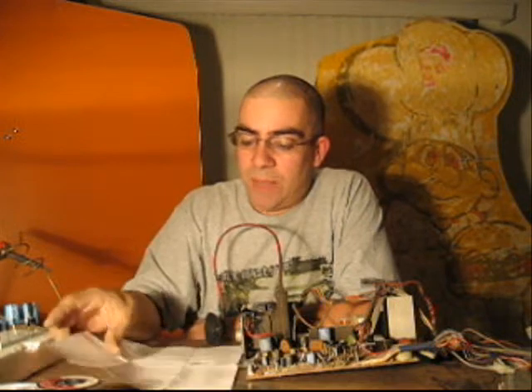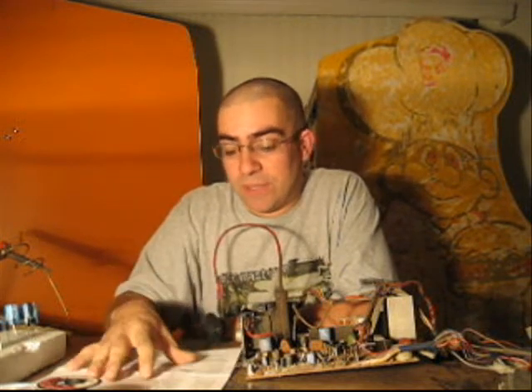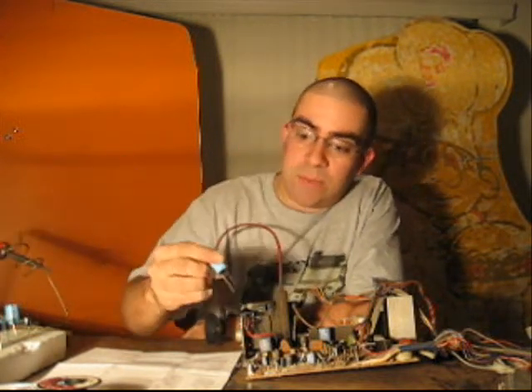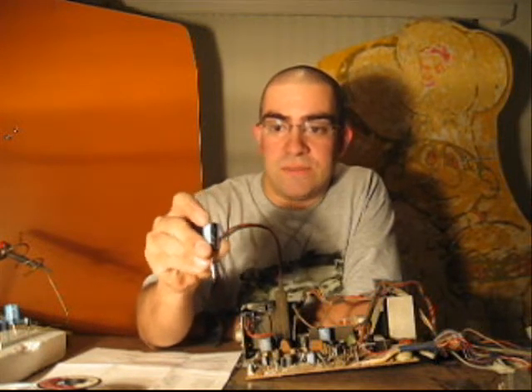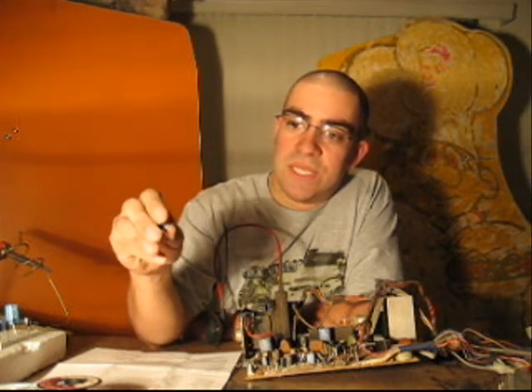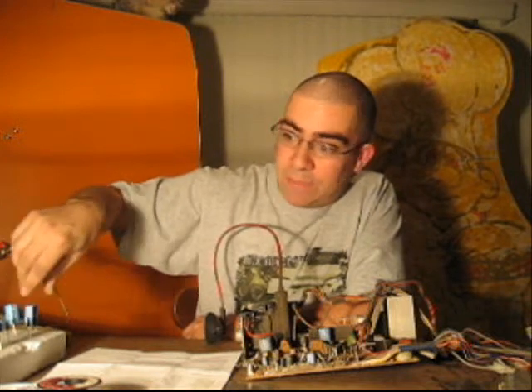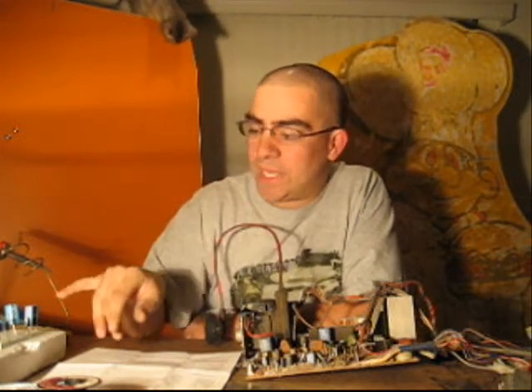Just a note — this is the very first cap kit I did, and I've run into this with every cap kit since. Bob has some very important notes at the bottom of the sheet, and you need to go ahead and read them. They tell you that your capacitors have polarity — a positive and a negative side. The black stripe on the capacitor denotes the negative lead, so the short lead is your negative and the long lead is your positive.